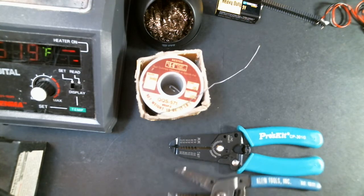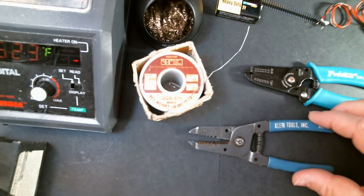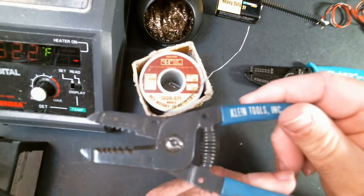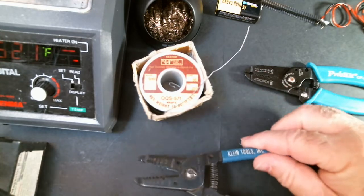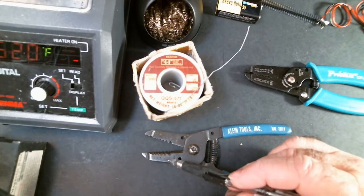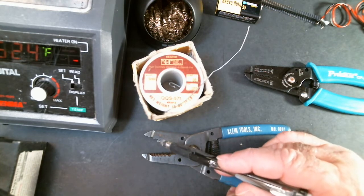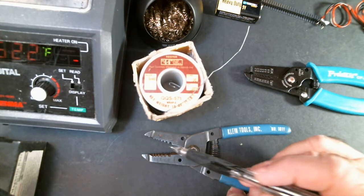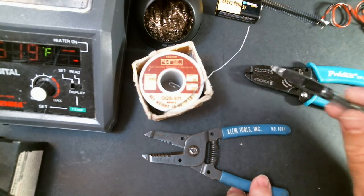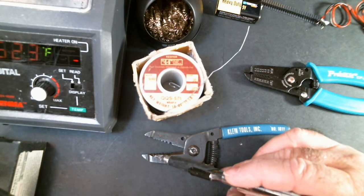This here is my electrician's pliers — wire strippers. Let me zoom in here. So this here shows 10, 12, 14, 8, 16, 18, and 20. The 20 is too big — you will not be able to strip wires properly. Klein is a very good brand; they do make some smaller diameter tools. But this older pair just shows you that 20 is too big.